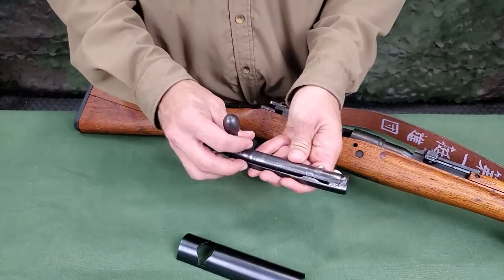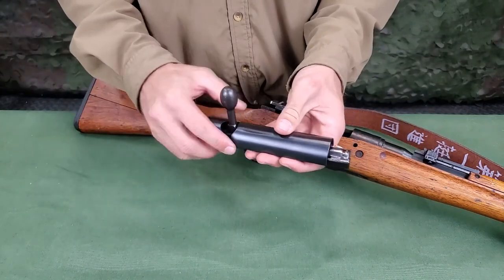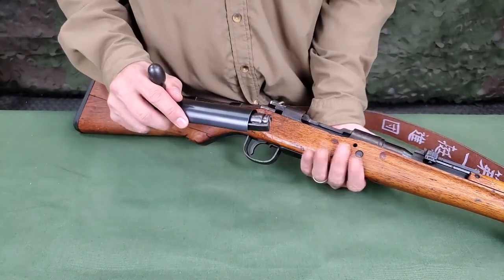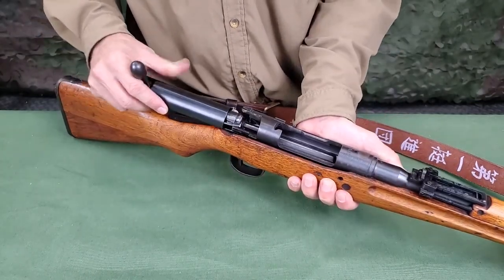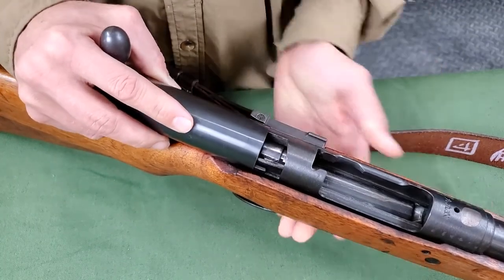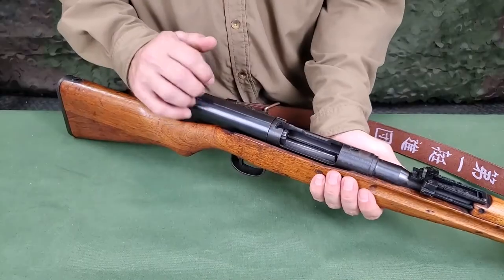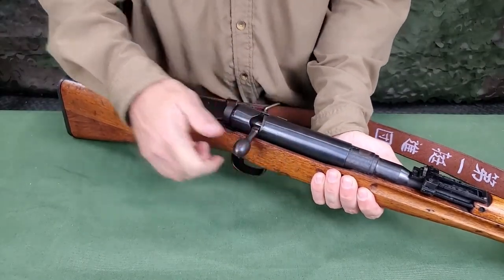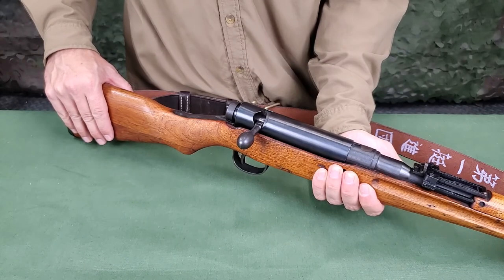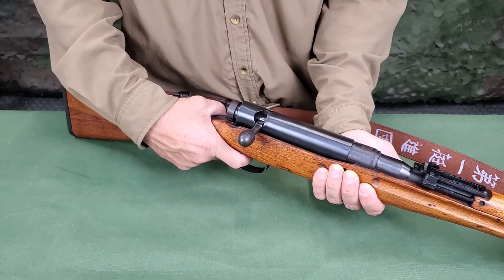The bolt cover can then be placed on the bolt by placing the bolt handle through the hole in the bolt cover. When the bolt is fitted into the receiver, the correctness of the bolt assembly is rechecked. The catches on both sides of the bolt cover are fitted into the grooves on the sides of the receiver. The bolt retainer is opened outward, the bolt pushed forward, magazine platform depressed downward, and bolt handle lowered, completing assembly. Then the trigger is pulled and the firing pin is left in the sear catch position.